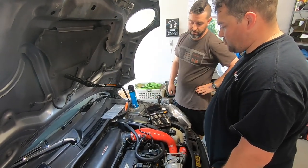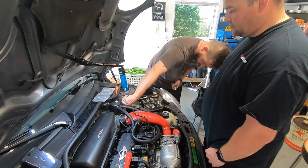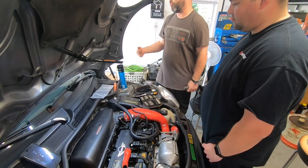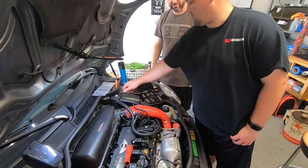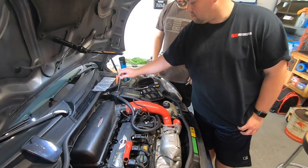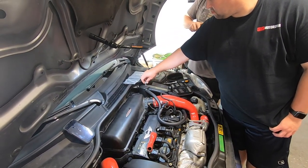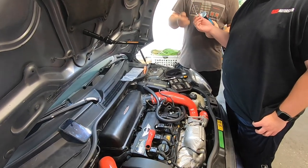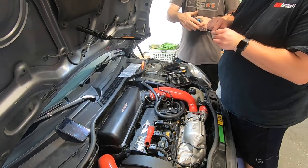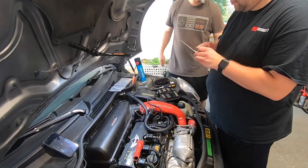So when you need to drain these, take that screw out — pull that plug and put it into a coffee can or a one-liter container or whatever. This is just to check. It's actually sealed by an O-ring. Here's what I'm going to do: pull that thing out, take a little grease, put that on the O-ring — it's going to make it easier, keep it lubricated, keep it soft, and keep it sealing. It should be good to go.